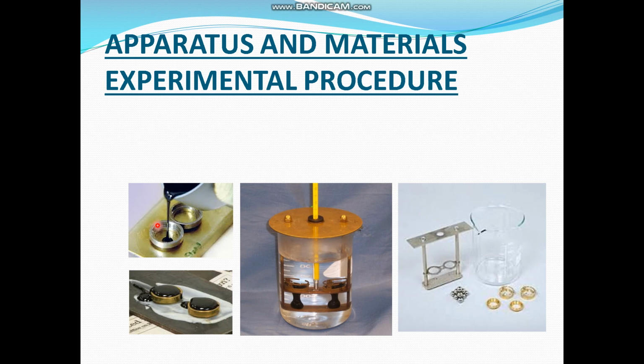The rings are filled with bitumen and left for 90 minutes in an air-conditioned environment, after which these rings are placed in the holder, on top of which the balls are placed, as being shown over here. Then the beaker is heated so that the water temperature starts rising, at a controlled rate of 5 degrees per minute. In the ring and ball apparatus, there's a heater with this equipment which comes with the softening point apparatus.